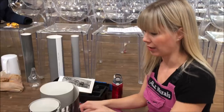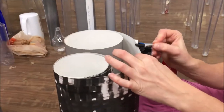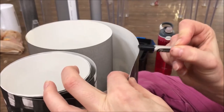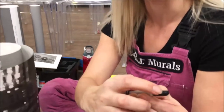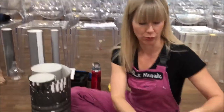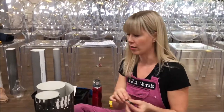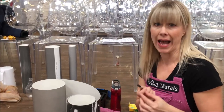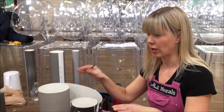I'm going to color the edge — you can really see the white edge here against the black pattern — and just gently color it with the crayon over the dark and light gray areas. Over time you'll get grooves in the crayon from the paper, so use a fresh section of the crayon as you go to avoid coloring the front of the wallpaper. You don't have to worry about the crayon washing off either — it's wax-based so it's water resistant, it'll stay on the seams and won't wash onto the front of the pattern.